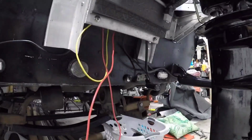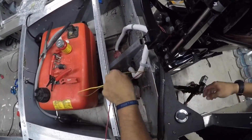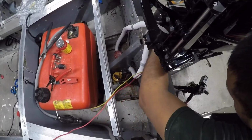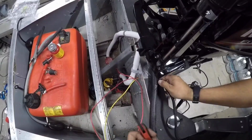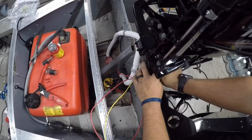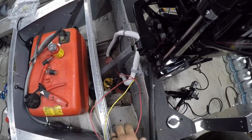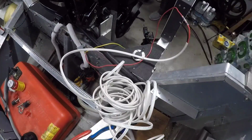But I already had pre-drilled holes in my transom from not having a jack plate and mounting multiple motors on it, and I hated that. But they actually came in fantastic handy because I took these wires and I just straight up stuffed them in those holes and pulled them through, ran them in looming, and pushed them down the transom into the power ports that ran into the main wiring section, as we will show you later on. Stay tuned, by the way, for the most epic wiring job I have ever done, and I'm glad to have done it in my boat here.